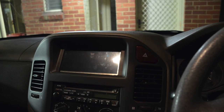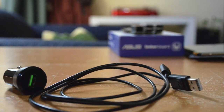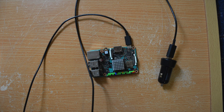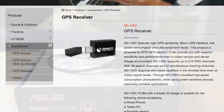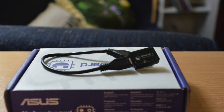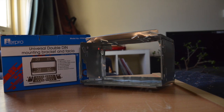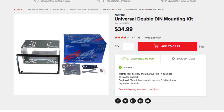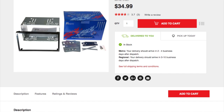In order to mount it in the car you will need some additional pieces of equipment. First of all you will require a car cigarette plug to USB adapter — find one that is rated to at least 2 amps since the Tinker Board can become quite power hungry. One thing that I purchased that isn't necessary but I would recommend is a GPS receiver. This will allow you to use the Tinker Board for navigation and even to track your vehicle if it gets stolen. We'll mount the Tinker Board itself in a universal car mounting bracket — most cars have a standardized dashboard bracket size, so I bought this standard size box which we will be putting the Tinker Board and the screen in as well.